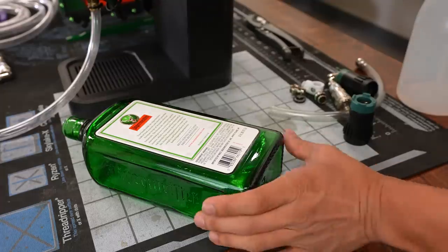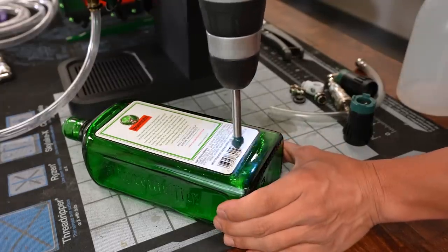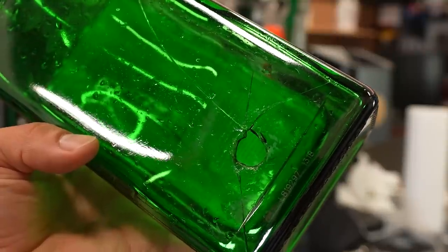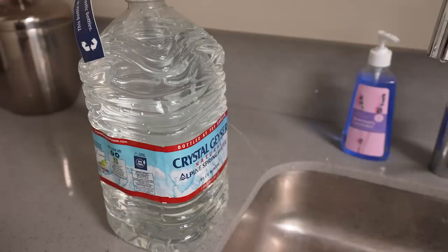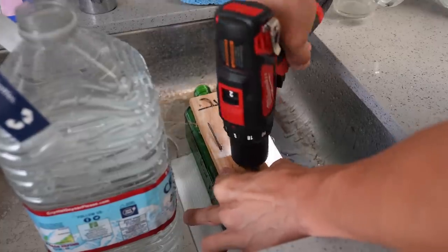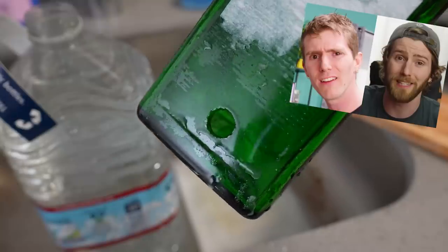So far, so good. But trying to sort out the tap machine connections had me questioning my manhood. The first step was to drill a hole into the glass bottle for routing the inlet tube. So I grabbed a power drill and immediately messed up the bottle — the glass cracked in spectacular fashion for one simple reason: I hadn't properly cooled the drill bit when in use. First time drilling glass. A few YouTube tutorials later, my second attempt went a lot smoother. By water cooling my hardware, using a higher quality drill bit, and stabilizing my tool for added precision, I cut a hole cleaner than Linus' face pre-2020.